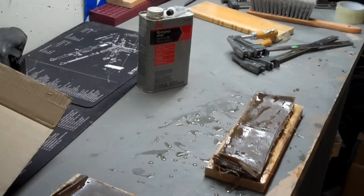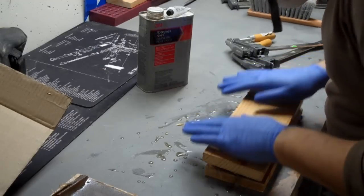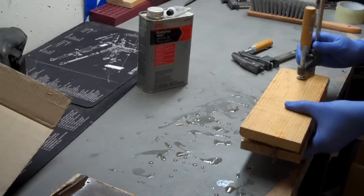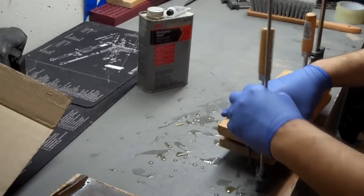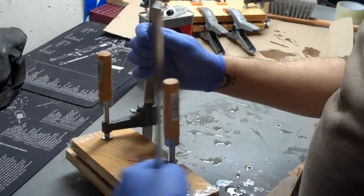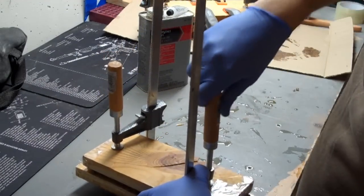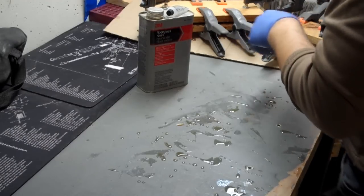Once I'm satisfied with the amount of fiberglass within all the fabric, we clamp them all down and apply a good amount of pressure. With as many clamps as I own, this pressure will make a very fine texture in the finished micarta — it almost comes out as a wood grain, and the more pressure you put on and the finer the layers, the more fine the grain will appear. We let that cure overnight, basically about 12 hours.